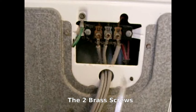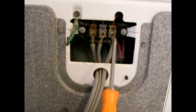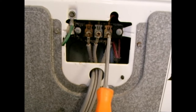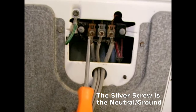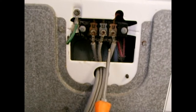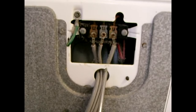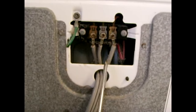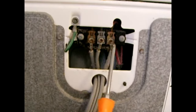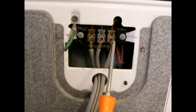Make sure you have 240 volts across those two outer screws. Then probe from each end to the center to verify 120 volts between each outer screw and the ground. Don't only do the 120 to the middle on each side, because a faulty circuit breaker can fool you — it will show 120 on both sides but the loop won't be completing. You must verify 240 volts between the two outer screws AND 120 between each outer screw and ground.